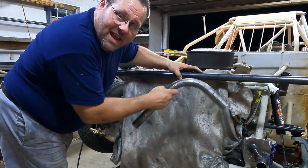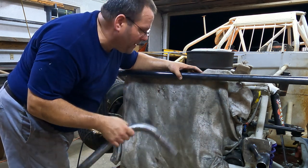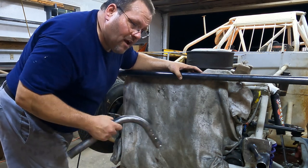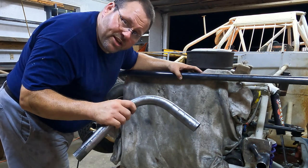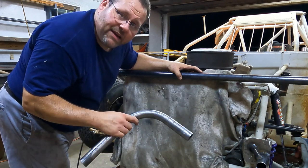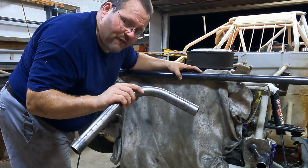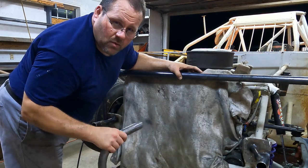I always use my cheaters like this because they'll show you exactly where to bend. I use a JD Squared manual bender — really good. I bought that thing at the beginning of last year when I started building this car, and I've been just super tickled with it. Go all the way back to the beginning of my street stock build playlist and you can see a lot more detail on that JD Squared, how I make the cheaters, how I use them to do the cage and the whole nine yards. I won't cover that here, but I've got a lot of information in those first videos on exactly how all that works. I just make these up — I've got them in a 90, a 45, a 22 and a half degree, and I've got my marks on them that tell me exactly where to put it in the bender to get my bend exactly where I need it. Works great.